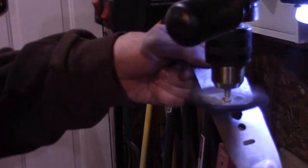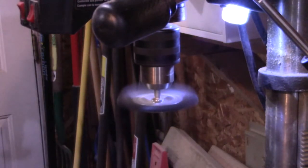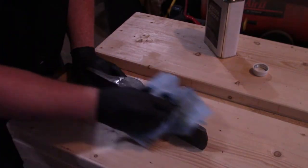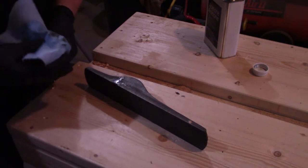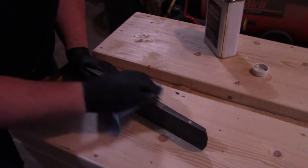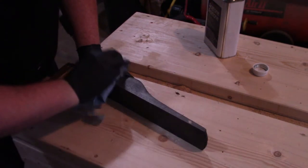About a year later, I threw a wire brush in my drill press at its highest speed and started attacking all of the plane parts with it. Fun fact — I'm still digging bristles out of that sweater I was wearing, six months later. Wear your safety gear. After the wire brushing, I broke out the acetone and gave all of the metal parts a wipe down to clean everything up. I think I need better cartridges for my respirator if I'm going to be working more with acetone, because even with the respirator, the fumes were ridiculous.